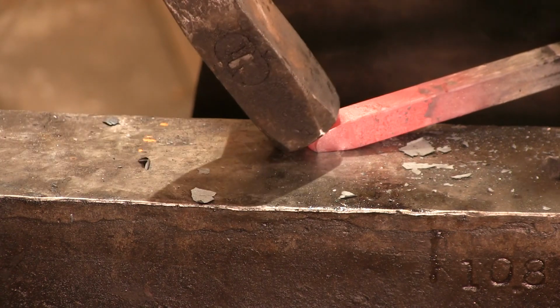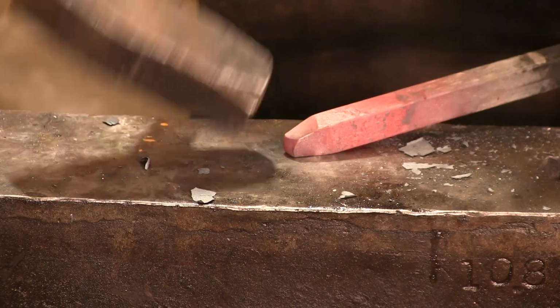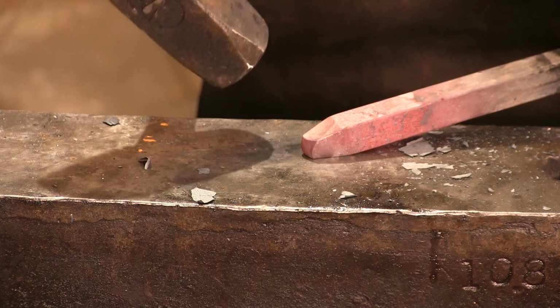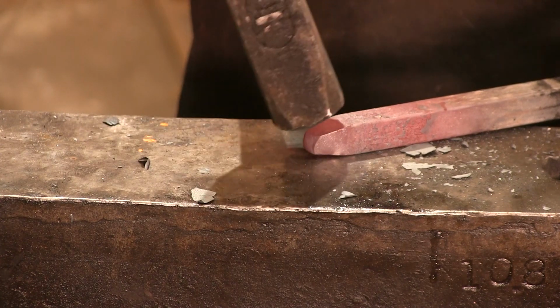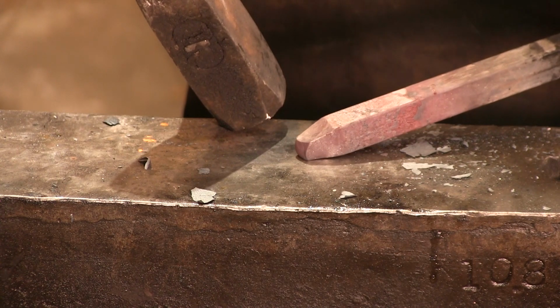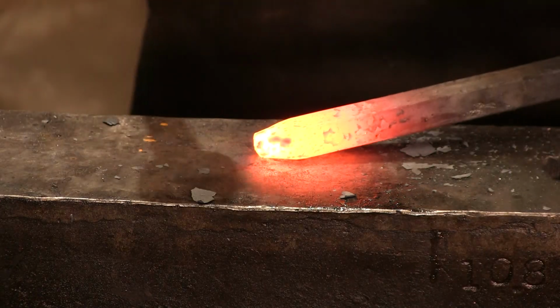But again, you can see we've got angle on the hammer, and also I'm lifting this rod to make sure that I'm making contact with the anvil. And just to drive this home, if I put my rod flat, you see that gap under there? That means that in order to actually do any work, I now have to mush this down to the top of the anvil, but that right there saves all that problem. Let's take one more heat. We have our second heat.